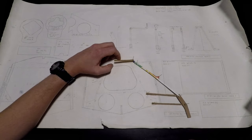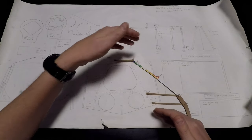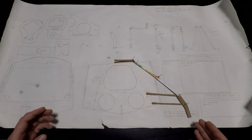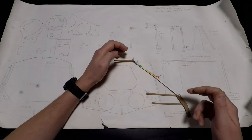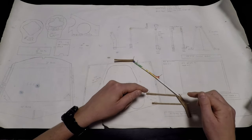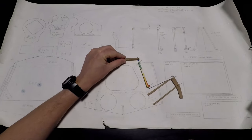A few important dimensions and compromises to note. The length of the A-arms is what determines the track of the landing gear, but that length is limited by the vertical space available in the fuselage. This airplane has an 86-inch wingspan, so the ideal track would be 21½ inches; the best I can get without changing the fuselage design is 18 inches — close enough. The upper and lower support arms need to be identical in length, as does the vertical distance between the inner and outer pivot points, to avoid any binding problems when retracting the gear.